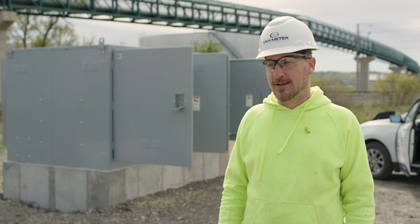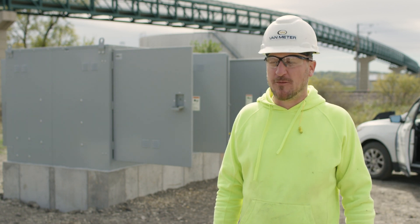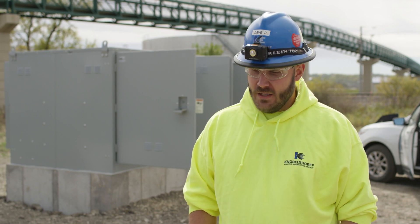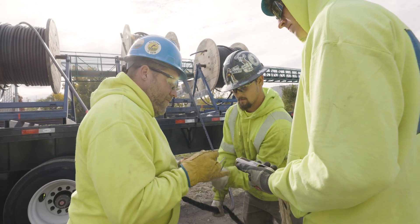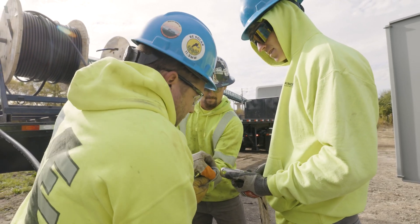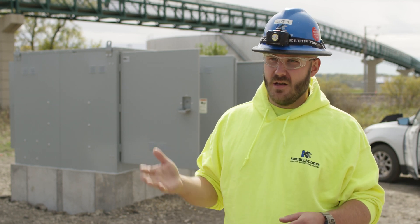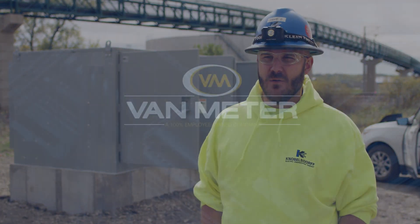We pulled all this wire in less than two hours today. In years past, that could have been a four to six hour project at minimum. There's been a lot of gain with bringing in Van Meter and the Southwire team. It's helped us come up with new solutions to pulling wire in ways we never would have thought of — with different clevises, hook points, and pulling points. It really helps get the crew out of the way so that you can safely pull in wires and terminate them. With the new equipment and how it all communicates together, it really helps you know exactly how much you're pulling, what your tension is, and whether you're hitting a pull point where it starts to bog down the machine.